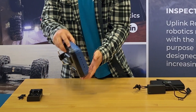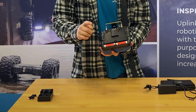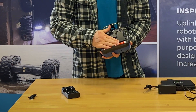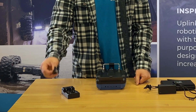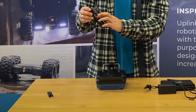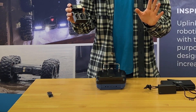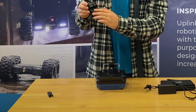The transmitter has batteries in the back — there's a little tray right here that you pop open. These are lithium-ion 18650 batteries, and we ship them with a battery charger. Whenever the battery dies, just pop these out, put them in the charger, and plug it into a USB brick. Be careful with the orientation — this isn't a AA battery; if you plug it in backwards it can be really bad. These chargers have reverse polarity protection, but it's best to be safe. Make sure you plug them in correctly and wait for the lights to turn green.